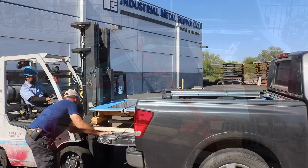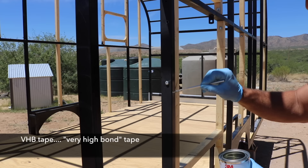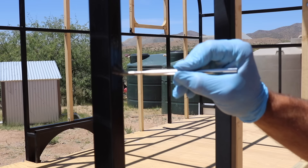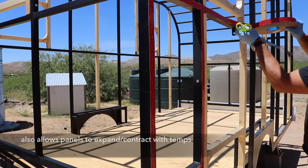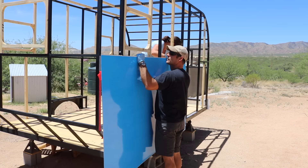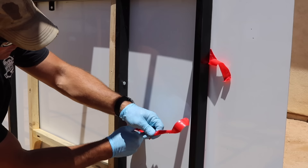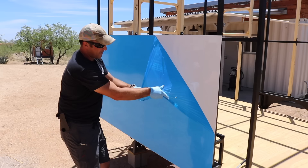The final and biggest step of this phase was attaching the aluminum panels to the frame. I didn't use screws or rivets — instead I used VHB, or Very High Bond, tape, which has been used in industrial and automotive applications for years and offers the advantage of no perforations or penetrations in the surface. It required quite a bit of prep because once it bonds it's very hard to get off. Both painted surfaces had to be finely abraded and a primer applied before the tape was put down. After each panel was on, all seams and edges were rolled to ensure proper adhesion.